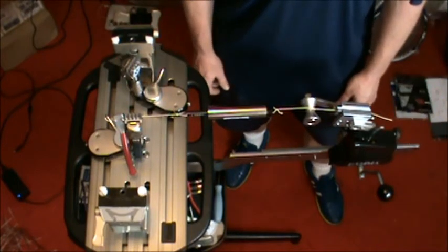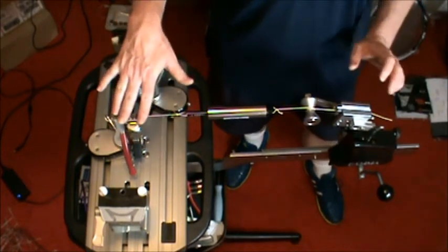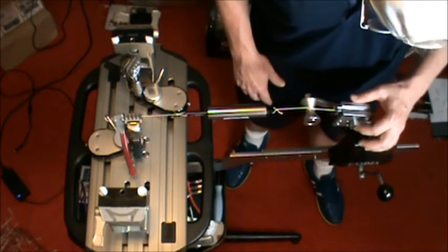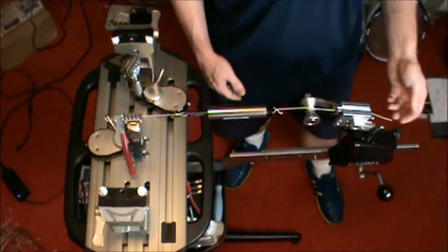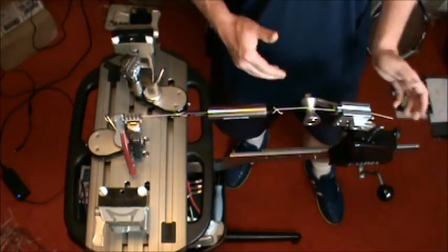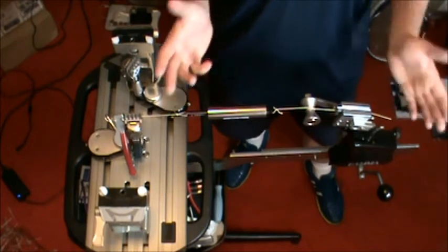So I think I've covered all of the important aspects of how to set up the turntable, how to come out of the string clamp, how to set the base clamp. I already tightened that set screw, so I don't have to go back and do that. So now this screw shouldn't come out of adjustment because the set screw is tightened up and it's pulling 40 pounds. When I set this at 40, it's pulling 40. When I set it at 50, it's pulling 50. When I set it at 60, it's pulling 60. And that's